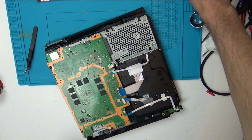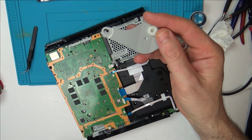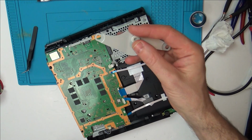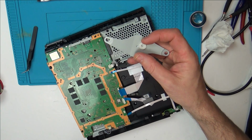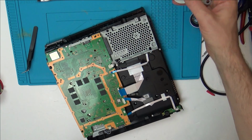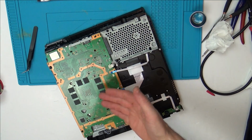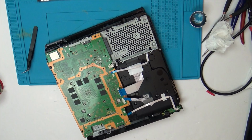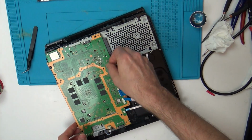Oh, and in case you're wondering about the dodgy thing where you put a washer underneath this, I've tried it. Remember, that's only going to work if, for example, the APU's balls have come unattached. And remember, I've already been putting pressure down on the APU and it hasn't made a difference. That fix isn't a great fix anyway, but it didn't make any difference. I used quite a thick washer, but I didn't screw it all the way down, but it would still put more pressure on the APU, bringing it up. So yeah, that's not going to be a fix in this case.